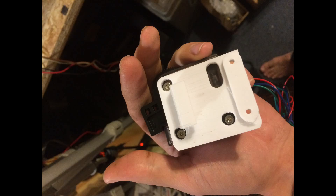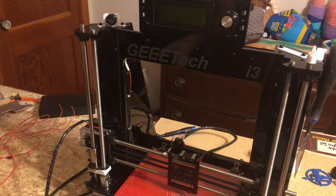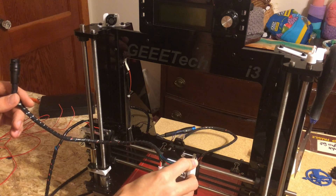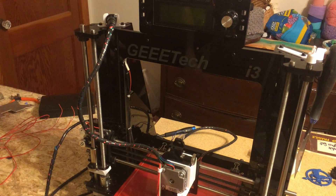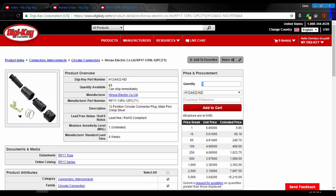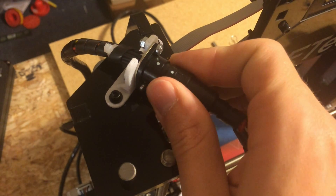After I had these parts, I needed the motor, which wasn't that big of a deal, so I ordered the first pancake stepper that I found on Amazon — link in the description. As I was ordering the stepper, I realized that I was forgetting one small but crucial piece: the electrical connector that'll join the modular printhead with the rest of the printer. Luckily, our pals over at Digikey have a wonderful world of components to choose from, so I promptly ordered some sleek self-locking connectors — link in the description. The hardest part of the build was definitely soldering the tightly arranged wires, but with a little patience and a steady hand, the cables were finished in no time.